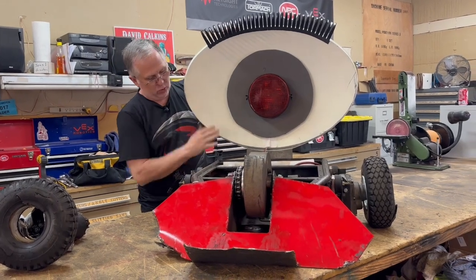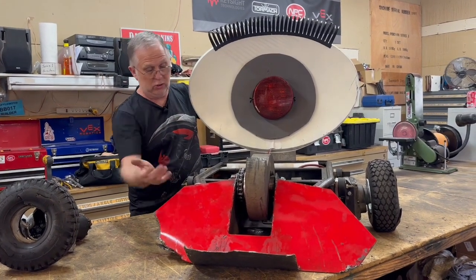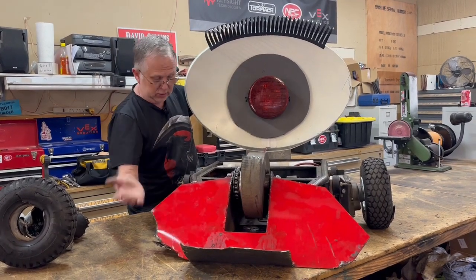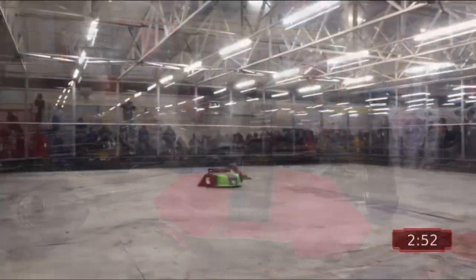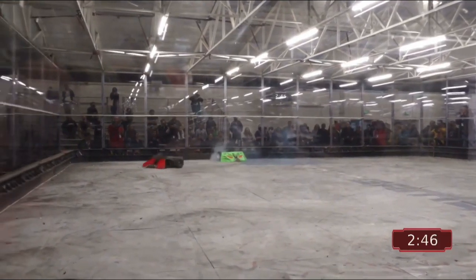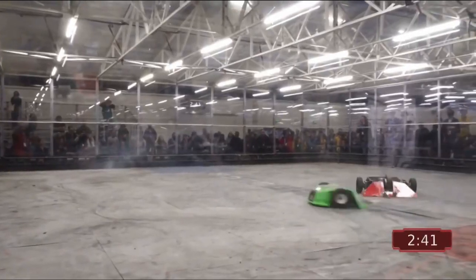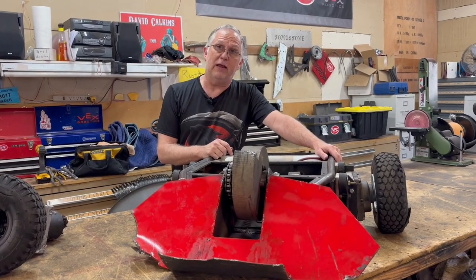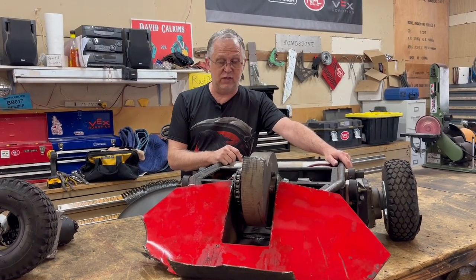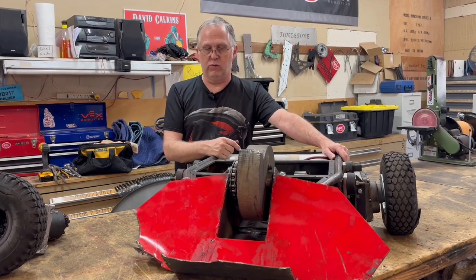Having that much weight behind the tires meant every time you accelerated, the front of the robot would pop up — the worst thing you can do with a wedge. So taking that weight off and adding weight on the front helped the robot drive better. In the match against Piranha it drove fairly well and we got the victory. Then we ended up fighting Manta, which was the overall winner for the heavyweight class at this event — a very tough robot — and you can see the end result.